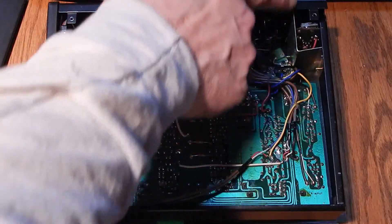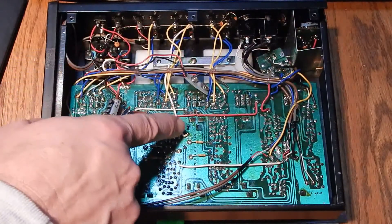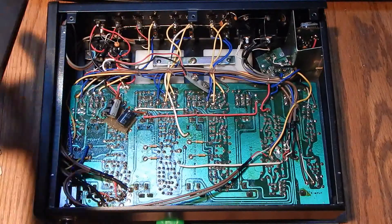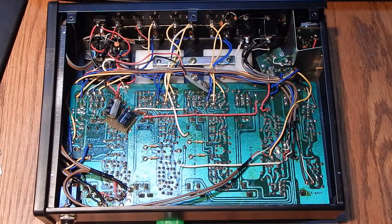I saw this little shielded area here - it turns out it's just two red wires and one white wire. They used white along with black for ground interchangeably. This must be a noise filter for the external power input, though it's kind of strange they put it all the way over there while the inputs are over here. They didn't wash the PC board at all - it's still got all the rosin on it from the factory. Rosin is non-conductive ideally so you don't really need to wash it off, but normally they do because they're worried about moisture and bacteria getting into the rosin, and it tends to collect more dust that way too.